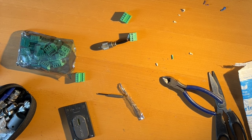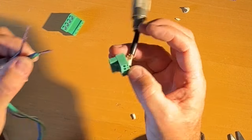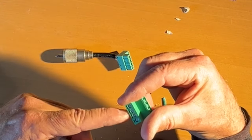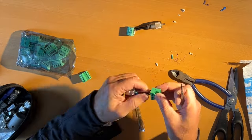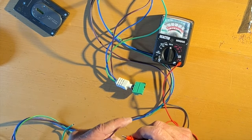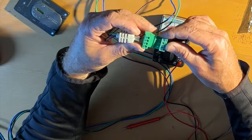On this side we're going to join the blue and green together. I'm actually going to make the performer, which is two elevated radials. And if I ever want to change this to one elevated radial, all I've got to do is undo the screw at the top and pull one out. Then the brown wire — nothing on that. We're good. So now I'm going to hook up the feed point.